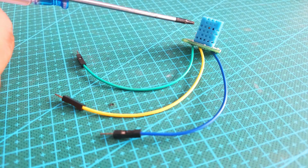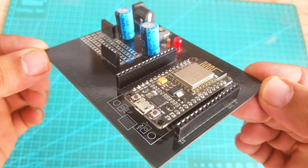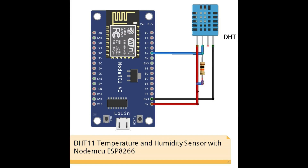The components and tools used in this project can be purchased from Amazon — the purchase links are given in the description. These are the minimal connections which you can start with if you want to use your laptop to power up the NodeMCU ESP8266. A 10 kilo ohm resistor is connected between the data and VCC pins, and the data pin of the DHT11 sensor is connected to the D4 pin of the NodeMCU ESP8266.